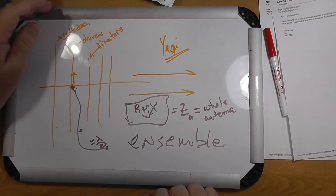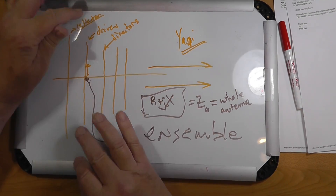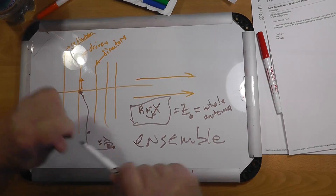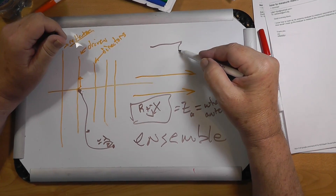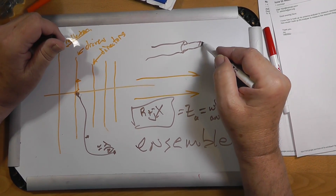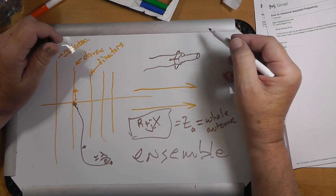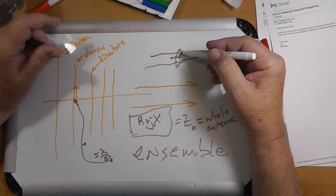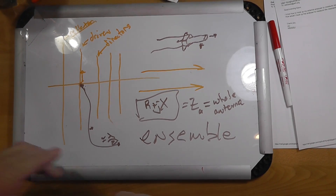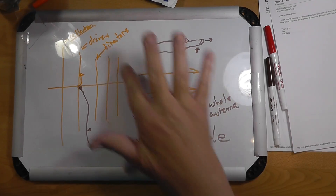So you put this up in place. If you find the antenna is too low in frequency, you can shorten the driven element; if it's too high, you can lengthen it. This is often done very simply by taking the tubing on your antenna and putting a smaller piece of tubing in here in a slit that's about a quarter inch wide, with a hose clamp around it so it doesn't move. If you need to lengthen it, just loosen the clamp and move it out, or move it in to shorten it. The bottom line of your question is that the impedance you are measuring is the ensemble impedance of the entire antenna.